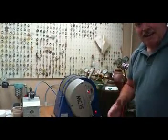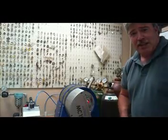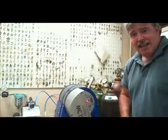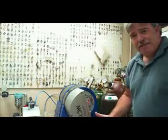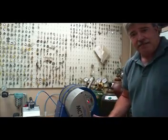Remember, it's filling up that cavity that we made inside the investment with all that resin and wax. And as soon as that's done, we're going to let it cool. We'll quench that, get the ring out, and I'll show you the solid model.